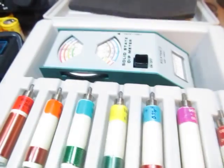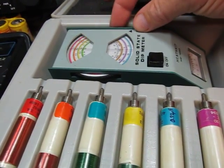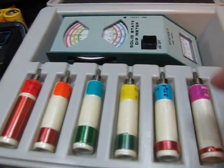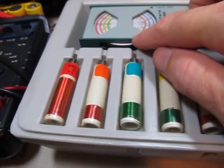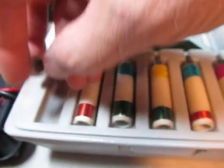Really what it is — sitting here in this box — is a meter that is essentially a variable oscillator. You can adjust the frequency of the oscillation on the dial here. You adjust the range by these various plug-in coils. Each of these coils covers a specific frequency range.